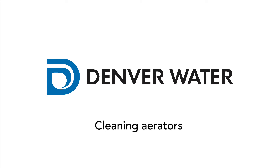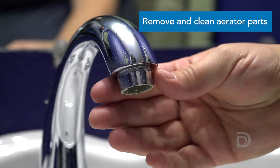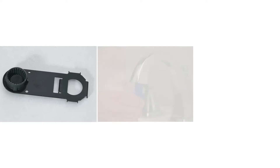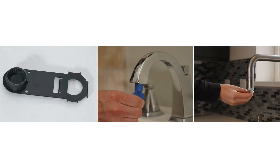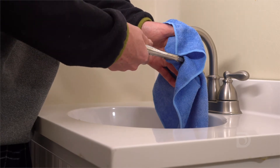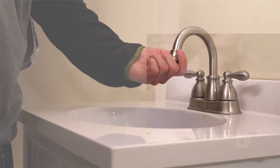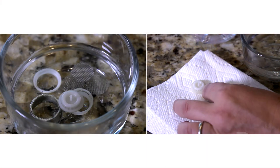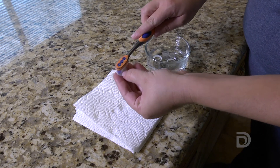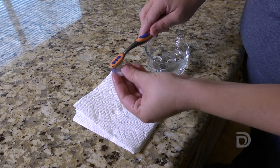Here are the steps to flush your pipes and plumbing properly. First, unscrew and remove the aerators or screens from all of your faucets. You may need an aerator key or tool to remove recessed or hidden screens. If the aerator is stuck, wrap a cloth around the faucet and use a vise grip, wrench, or pliers to loosen it up. Take the aerator apart and soak all of the parts in white vinegar for 5 minutes, then gently scrub them with a brush. Doing these steps will get rid of any lead or debris that may be caught in the screen.